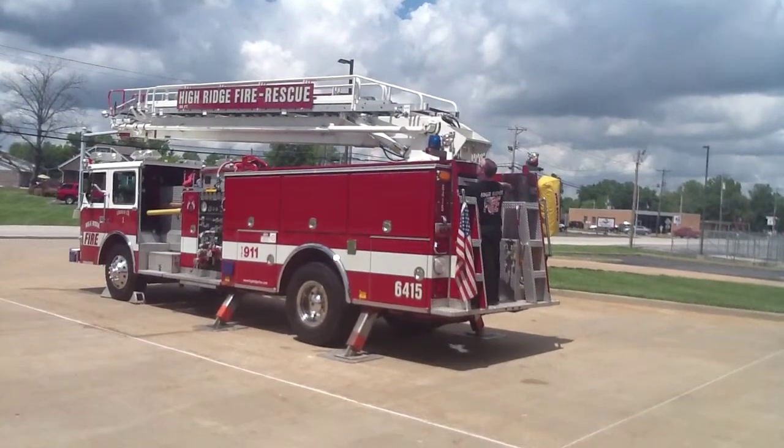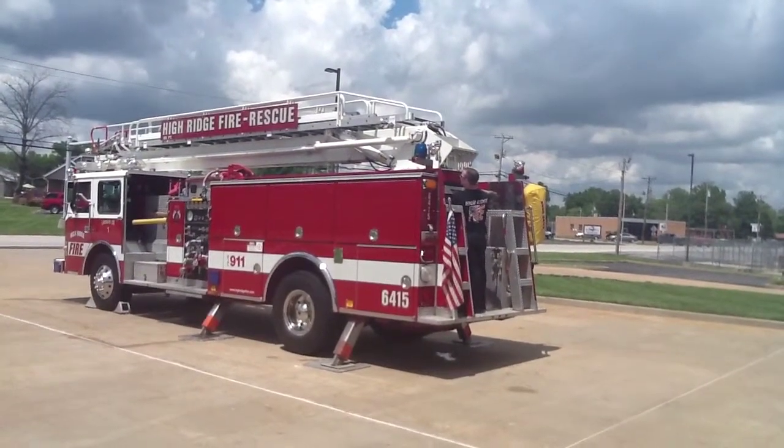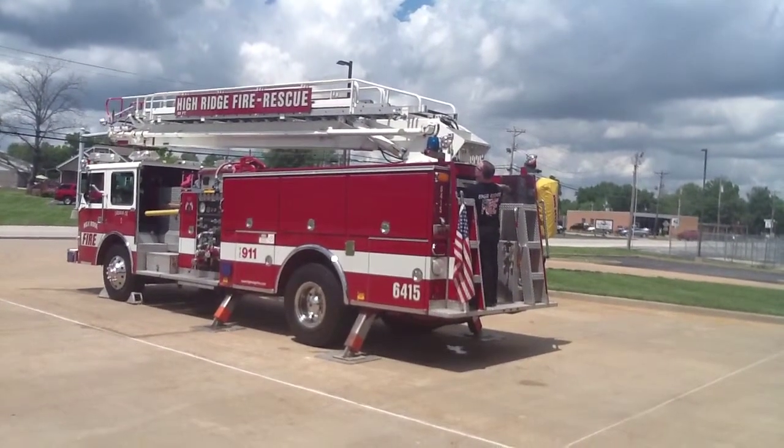After that, go around and visually check each outrigger to ensure proper placement. You may then operate the boom and nozzle controls. Remember to raise the boom to approximately 15 degrees, then extend, rotate, and raise as needed.